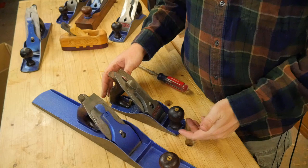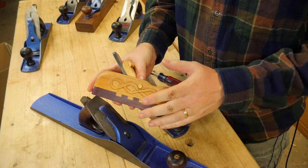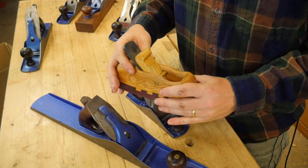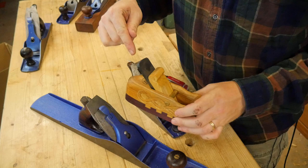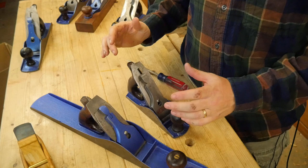That is a big change from the traditional wooden plane. Whether the wood has a single iron or a double iron, on a wooden plane all adjustment is done by tapping the iron and wedge. If you want a deeper cut you tap the iron in; a lighter cut you pull it out; shift it side to side you can do that. Everything is done by actually hitting the iron. Whereas on a Bailey pattern plane, everything has adjustability — either a knob or a built-in mechanism.